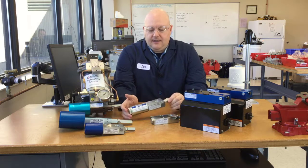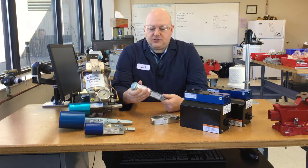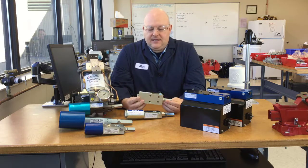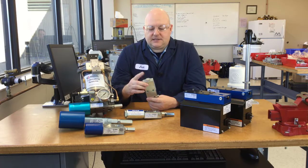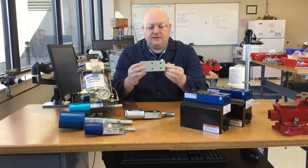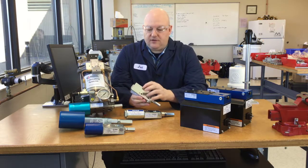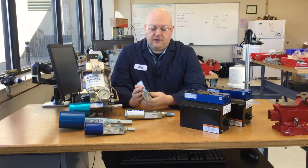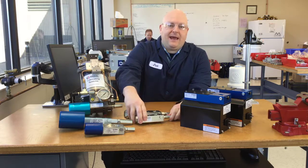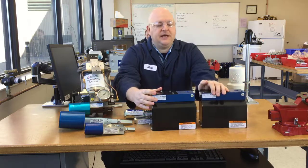On the hydraulic pumps, the HL25 has a silver colored cylinder chamber. On the HL5 and the HL5x there is just a hexagon plug at the end. You can see that all of these still have the same four holes for mounting, the same three holes that receive the o-ring to seal against the manifold, and the same bleed screw at the end. The hydraulic pumps follow the same bleed procedure as the pneumatic pumps.